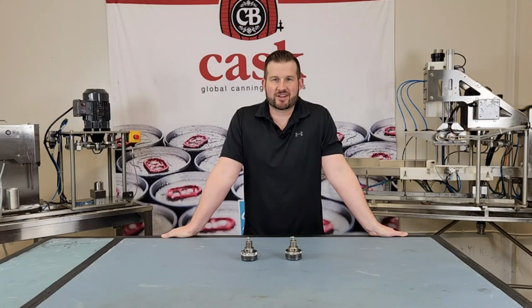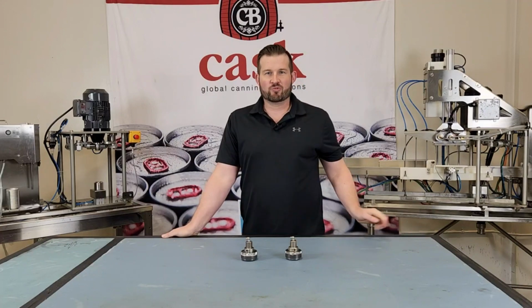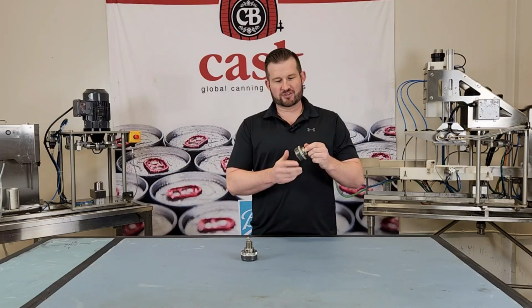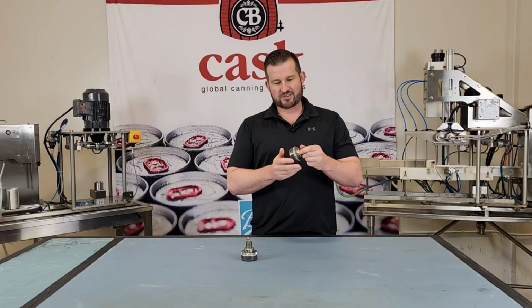My name is Mike. Today we're going to be going over a quick, easy die maintenance. This is something you want to do at the beginning of every run to make sure your dies are performing at their best. What you want to do is grab the rolling surface of the die and give it a good spin with your fingers. You're wanting it to get between 1.5 to 2 revolutions around. As in the case of this die, it's exactly where you want to be.